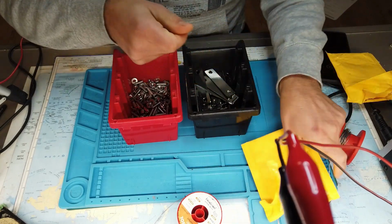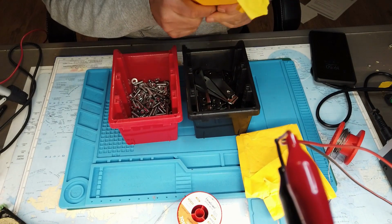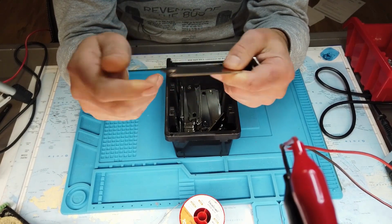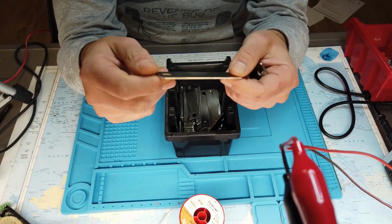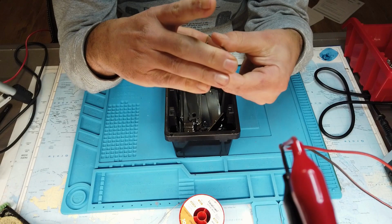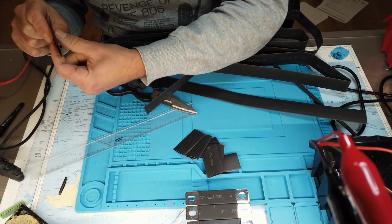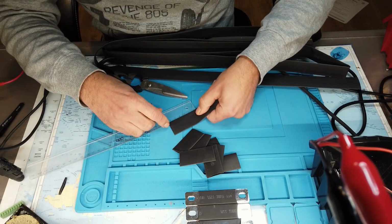Just check and double check you don't leave any nuts or screws or bolts. So the next step is to add a heat shrink tube on every busbar. It will prevent shorts in the near future. Let's hope we never face that issue. But it's for sure a safety improvement for the power wall. The diameter of the shrinking tube is 18, but of course there will be a link in the description of the video where I ordered my shrink tube.